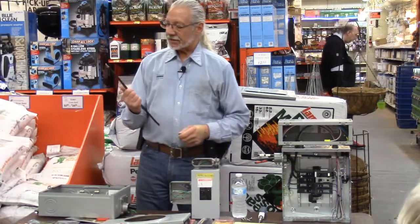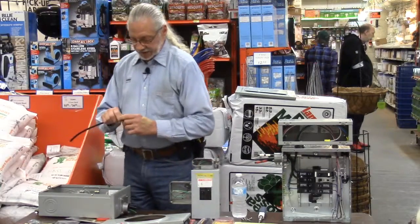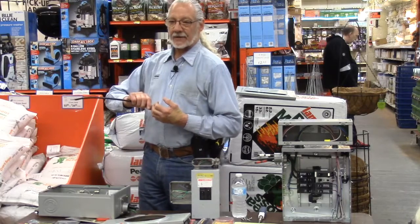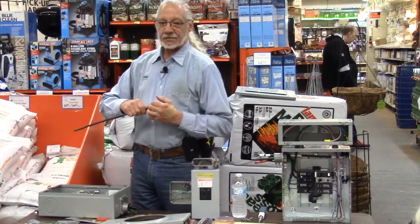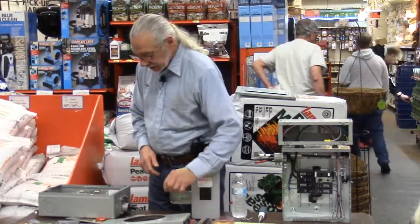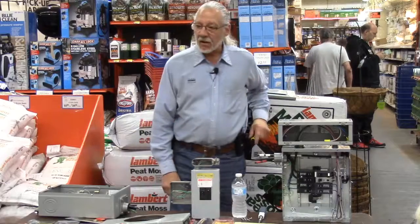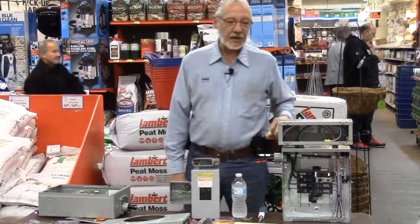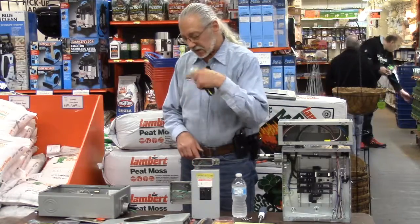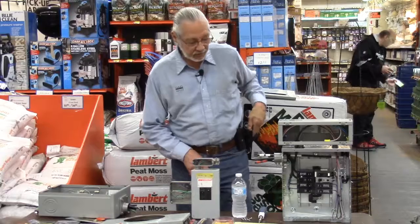And that's as simple as that with the heavy wire. Sometimes, like I said, you can rotate this, but a lot of times, if you're not careful, that can abrade the wiring, and it could crack off. So just be aware that there are special techniques and tools for cutting, and you're better off with a razor knife of some sort, just to cut through the insulation. And you saw I just went around it, cut the slit, and peeled it off.